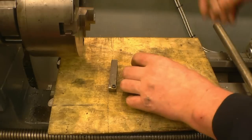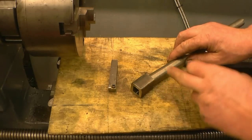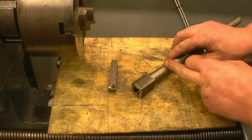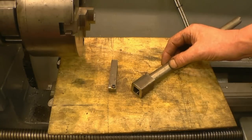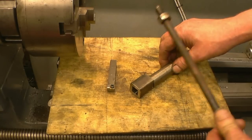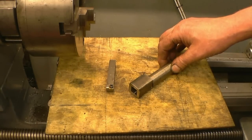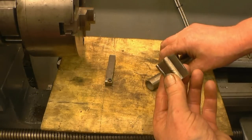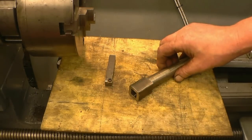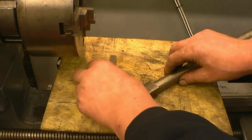This needs to be 100mm long, so what I'm going to do is extend it with a piece of that tube — simply weld that on — and then this end here needs a 12mm thread on, just for screwing in the handle. That's 12mm standard, so it's obviously not original. We'll face a piece of this off, measure it to length and weld it on.